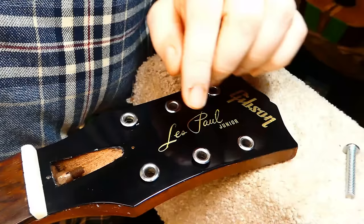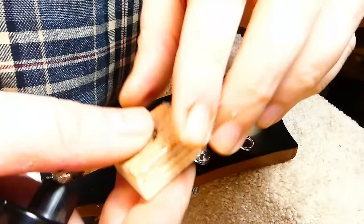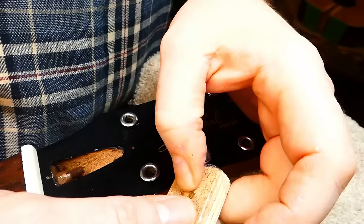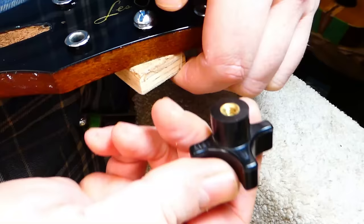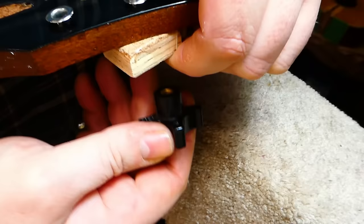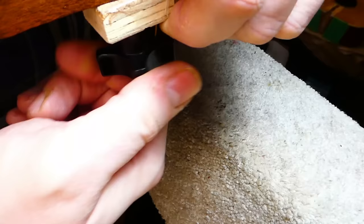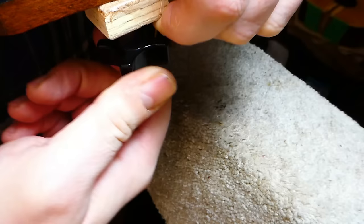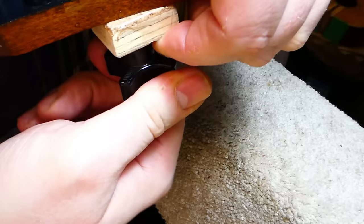These bushings need to be a pretty snug fit — another job that might be done with an arbor press, but I don't have one. I have this little screw thing: a quarter-twenty threaded machine screw with a little backing plate padded with cork. A knob with a through-bore, also quarter-twenty, just applies a nice even pressure so they don't go in cockeyed.